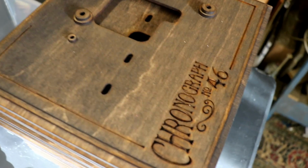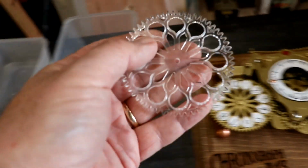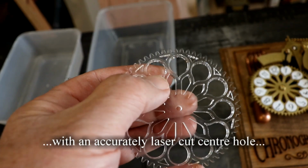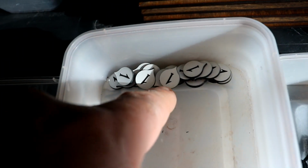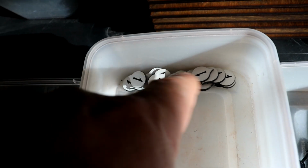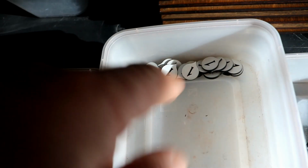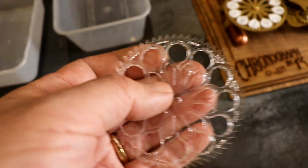Let's talk jigs. So, to make this, I cut and laser engrave this part. The reason for the funny teardrop shaped engravings is that I realised, as I've said before, very early on when I started making the first one with circular numbers, trying to get them lined up in the right place and everything was ridiculous, but having a teardrop shape means that they just slot in one way around. And again, what turned a horrible job into really quite a delightful one, if you like, superglue.